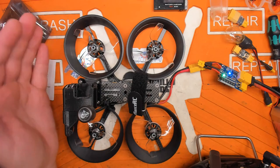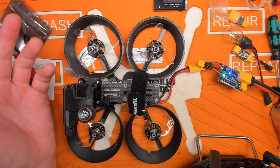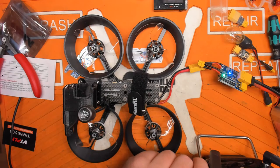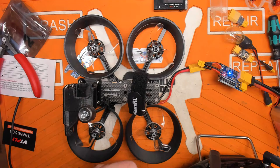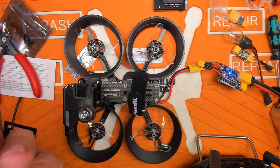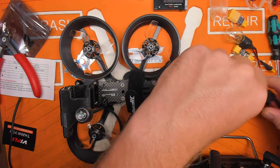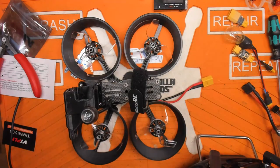When you're in Betaflight, you should take your props off. You should always take your props off. But let's face it, in reality, we don't always do it. But if you have one of these hooked up, here's what happens if you try to arm your quad. It just kicks off. So if it does decide to flip out and try to take a finger off, you should be safe-ish. So there we go. That's kind of what I wanted to get at, and that was a long way to get there, but we got there.